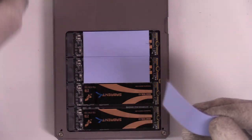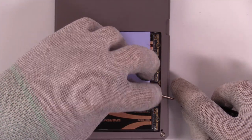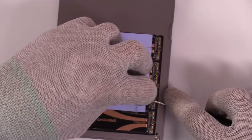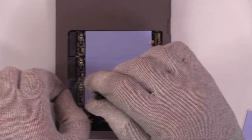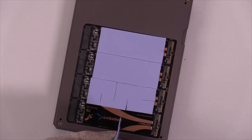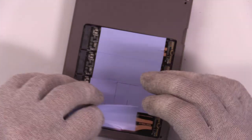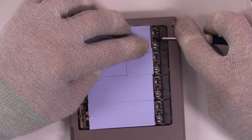I'm sure if we wanted to improve the thermal conductivity we would want to change out the thermal pads. I don't expect these to survive intact being used and moved around a lot. This third pad is giving me a little bit of grief — it walked a bit. For a device like this I would have thought they'd have one large thermal pad instead of these individual strips. I'm not fond of these little squares — since they tend to walk, I'll pull from the connector side.